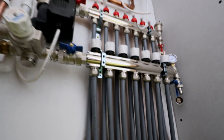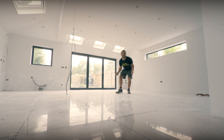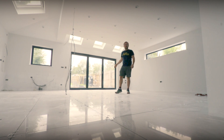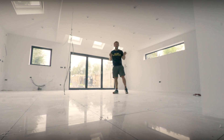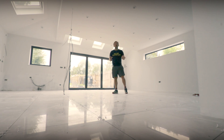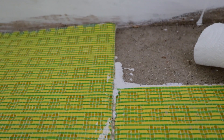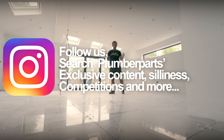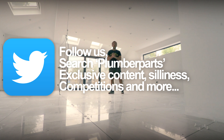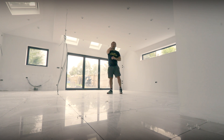Let's have a quick look inside the kitchen itself. There you go — all done, very echoey at the moment. Look at that — beautiful. The tiles are down. The floor's been running at 30 degrees because that's what the tilers wanted. This place was absolutely baking. If we look at the floor, the screed has got fibres in it, but we've also got a separate membrane between the screed and the tiles, so if there is any cracking there won't be any problems with the tiles as well. So that's how it's done. I hope you enjoyed the video, guys — please subscribe by clicking on the link appearing right now, and follow us on Facebook, Instagram, Twitter, and Snapchat. See you soon, guys.